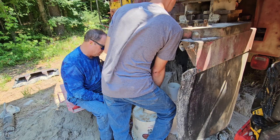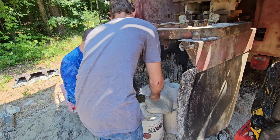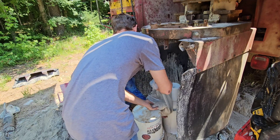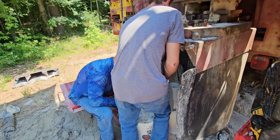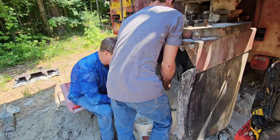I thought it was filled in again, but it wasn't. The pump was at 400 foot with a 380-foot static level. So when we went back we cut the well to like 480 foot. Some weird stuff. And we set the pump down there on black poly pipe — we extended it. Ordered a 500-foot roll.